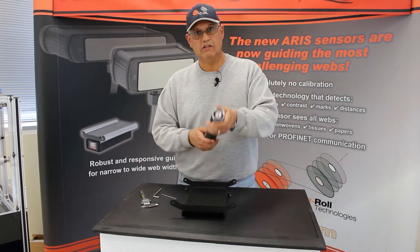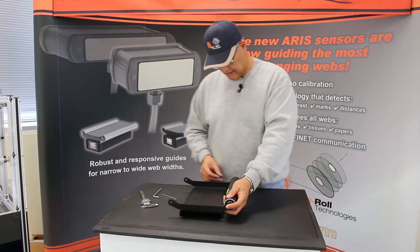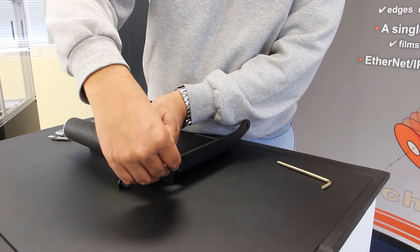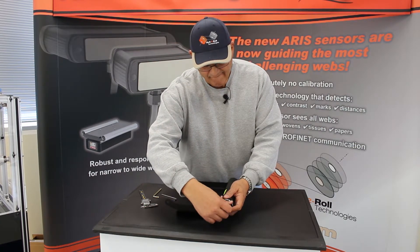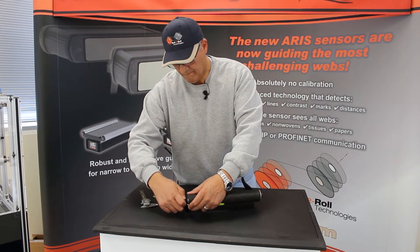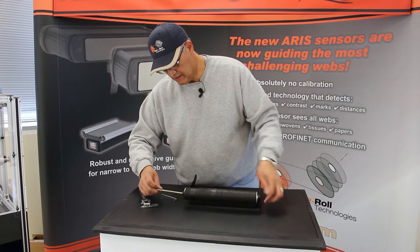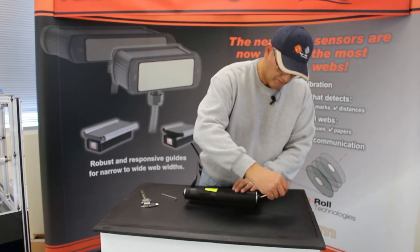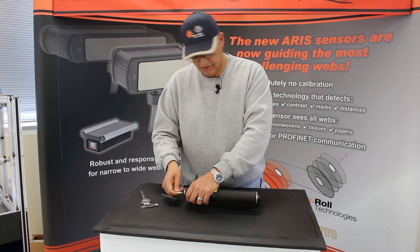Installing the roller onto the roller plate is a fairly simple operation. Just align the holes of the shaft to the holes on the roller plate, place your M8 screws on it, and screw them on. Finish it off by tightening with a 5mm Allen wrench. Once you come to the lock screw, just give it a quarter turn — that'll be enough.